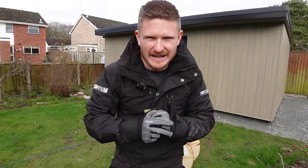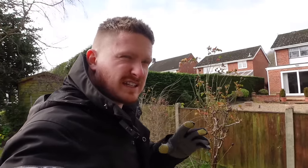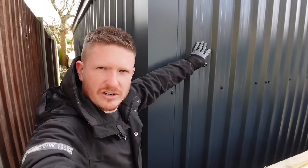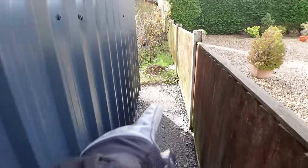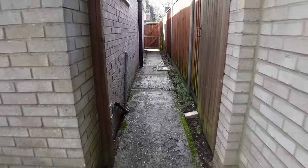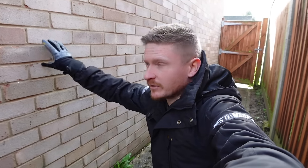The reason it's going to take some effort is because we need to run the cable quite a long way — about 46 meters from the consumer unit, around the front of the house, through the garage, to the workshop. The consumer unit is going to be on the other side of this wall at the back corner of the workshop, and we need to run our cable all the way down behind this old shed and along the side of the house, then gland it off on this wall so it can go through to the consumer unit in the garage.